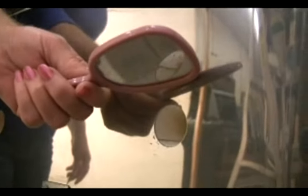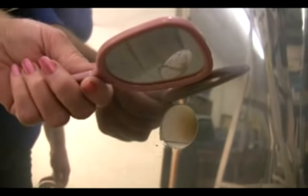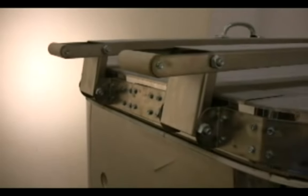If you must fire moist ware, wait until all signs of vapor have disappeared before heating past 200 degrees Fahrenheit. You can check for moisture by holding a mirror above a peephole.